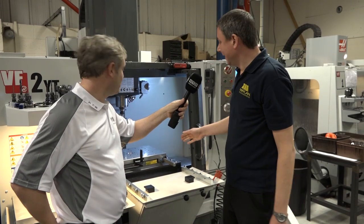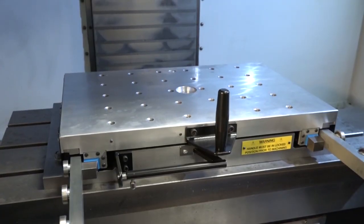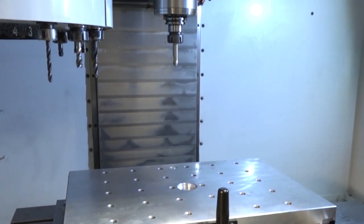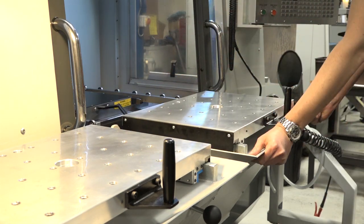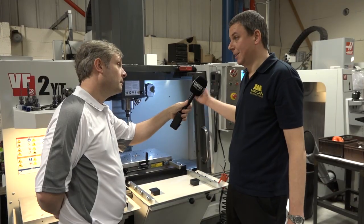So that was it working. Basically you've got your components on the pallet top in there — your fixture, your vices or whatever. So as soon as the machine stops machining, cycle's finished, open the doors, pull the pallet out, swap it over for the next pallet, push that in, lock it into position, repeats within 20 microns, and just press cycle start again.